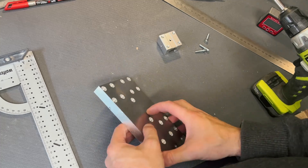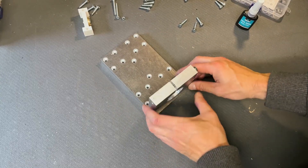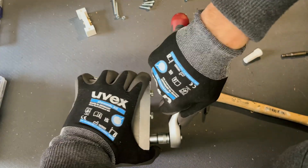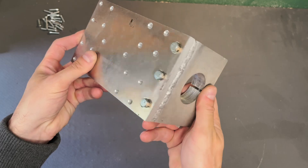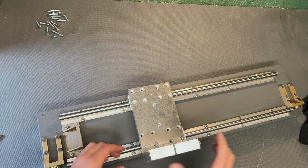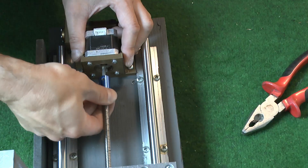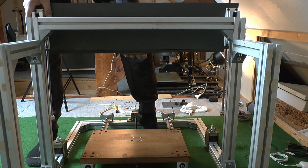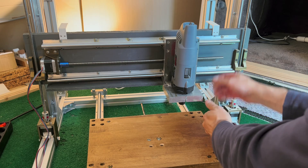I made an aluminium plate to replace the previous wooden plate and it gets the linear guides for the X-axis. Then it gets a plate that secures the spindle into the X-axis plate — I fasten it with three bolts, put it exactly right, and weld it so that it doesn't go anywhere. I install the drive nut and fasten it to the gantry slides. I fasten the lead screw into the X-axis and install the gantry into the Z axis, then install the spindle — it feels rigid and without play.